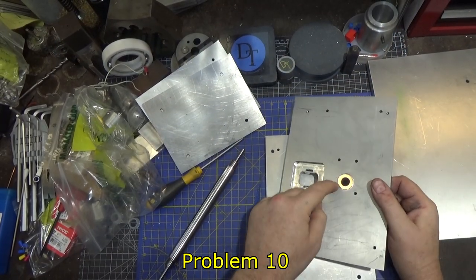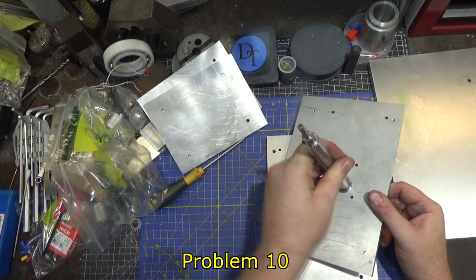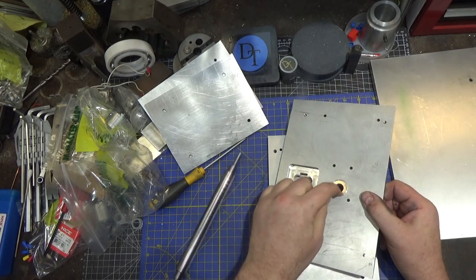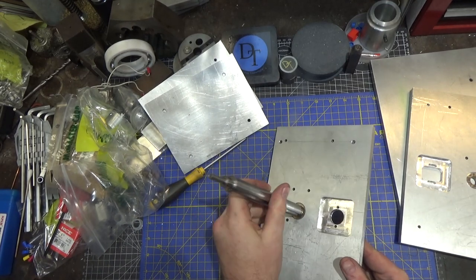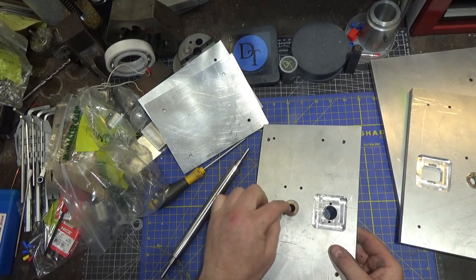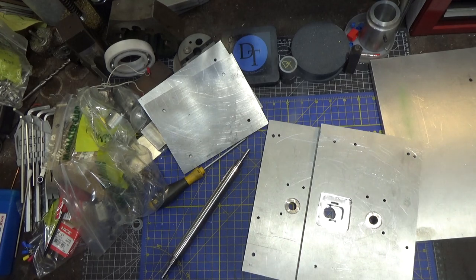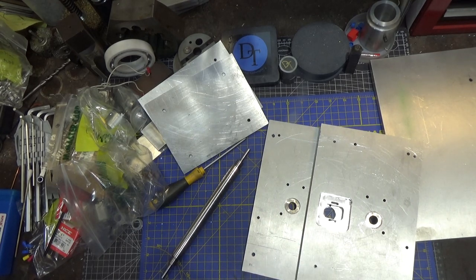You gotta love this. So I got these down to size, pressed them in, and guess what? Squeezing those took them from a nice accurate fit to a too tight a fit, especially up here towards the front. Same with this guy. Both of them did the same thing. So they're sort of tight towards the top, or towards the back actually, where the material's thinnest. I guess that makes sense. This wasn't a heavy interference fit, maybe 1/1000th or two, but is enough. So now we're going to use the same technique that I used to enlarge the holes to begin with.